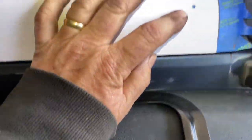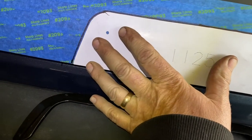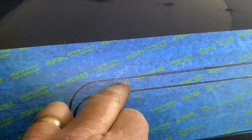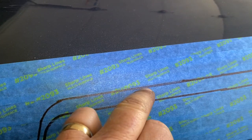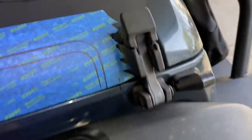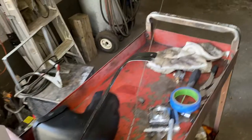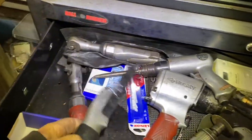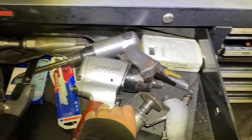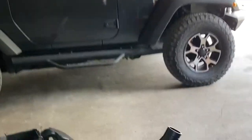Make sure it's nice and tight, go around and trace it. The top line is your cut line. Cut it and leave the line — don't go over, go under, leave the line — and cut all the way around. How you cut depends on what you've got. I'm going to use a cutoff wheel on a Dremel. You can also use a metal blade, but I prefer the cutoff wheel because it doesn't vibrate as much and cuts through like butter.